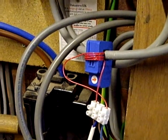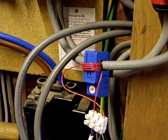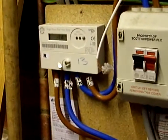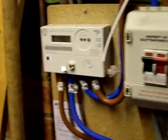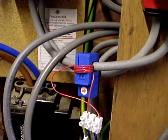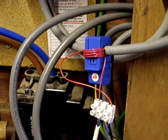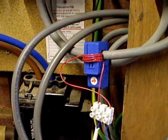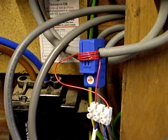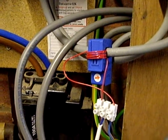What this does is influence the signal that the CT is taking. So rather than just measuring the power coming from the grid — because this is adjacent to the grid supply point, there's our standard Landis meter two-pole isolator — one of the six turns with the 60 watts flowing is going to counteract the incoming flow in terms of flux.